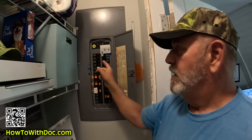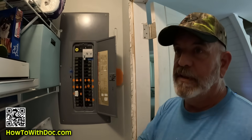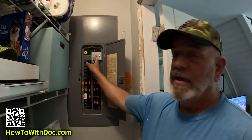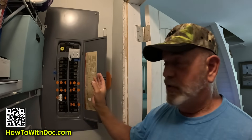What we're going to do is trick the plug situation. We're going to take an RV plug, which I'll show you in a minute, and there's a conversion that you can buy that converts it into a four-prong 240 that will send power to this box. But you've got to remember, you're not sending two 120s - you're only sending 120 to this box. So that 120 is running down both sides, but it's not enough to power the 240. Make sure you understand this. If you don't, drop a question down below, but I would definitely have an electrician come out. You have to have an electrician come out and do this by code. They need to install this interlock and test everything. I told my electrician I don't plan to run 240 - I plan to shut off all my 240s and do the conversion plug. He said that's fine - a lot of people do that.